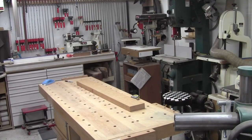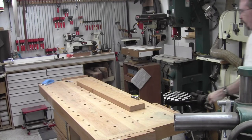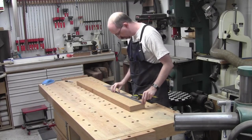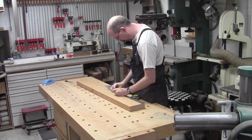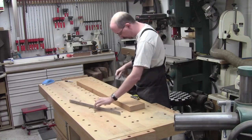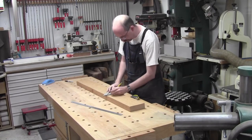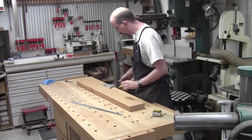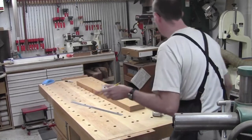Okay. So our first major cut — I'm going to grab my try square real fast. Just do some rough layout here. The first major cut is going to be at 400 millimeters or so, and I'm going to go a little wider than that. We'll do 410. So right about there — that gives me some room for squaring up. So there's the first cut potentially.